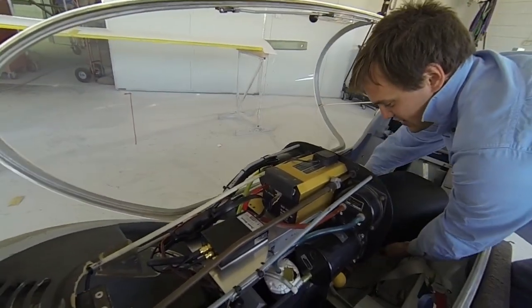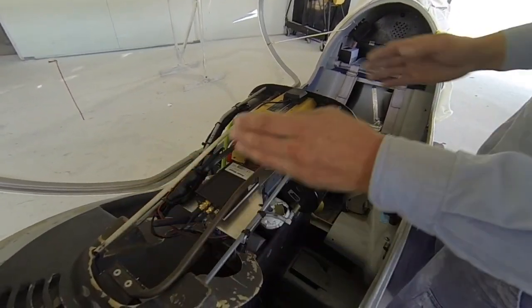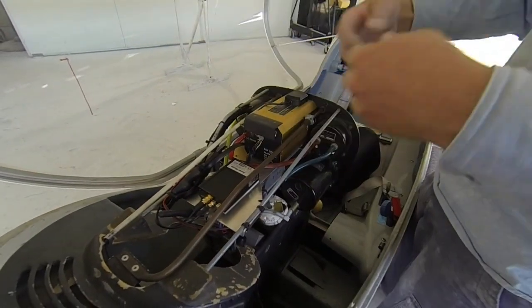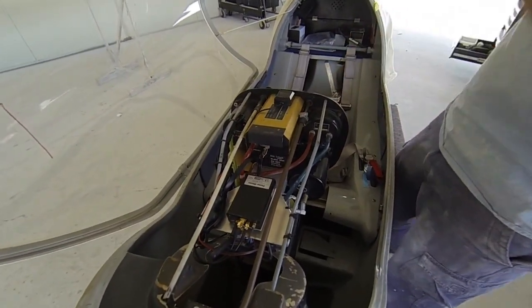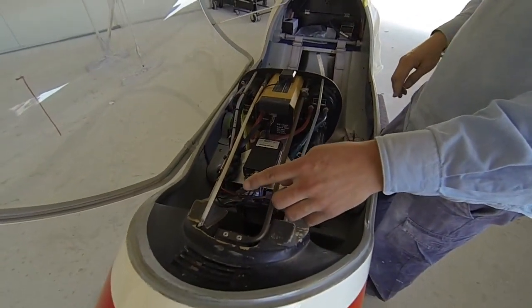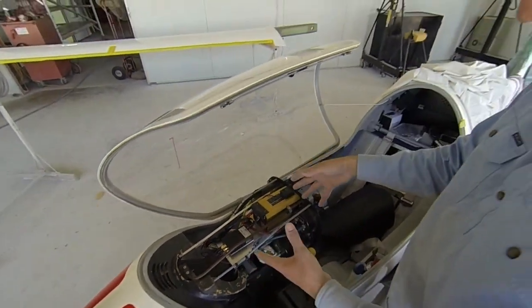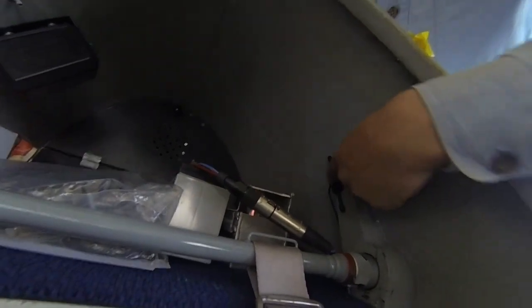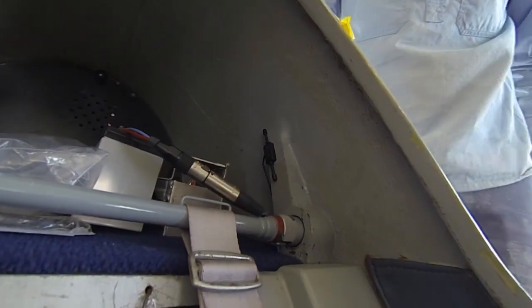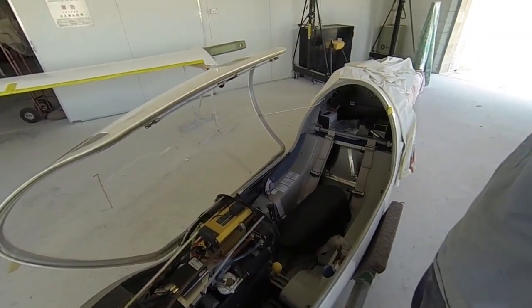It's basically the same as last time except I put this little tray here, because I wanted to keep the aerials as far away from each other as we could, and up top so there's as minimal interference as possible. We had the trouble of where to put things — this is GPS, this one's for the ADS-B. We decided the best place for the FLARM antenna was back here, away from everything, so it just hides in there. That aerial is the FLARM — it'll talk between gliders. This one talks to the power planes, and that one's the GPS.